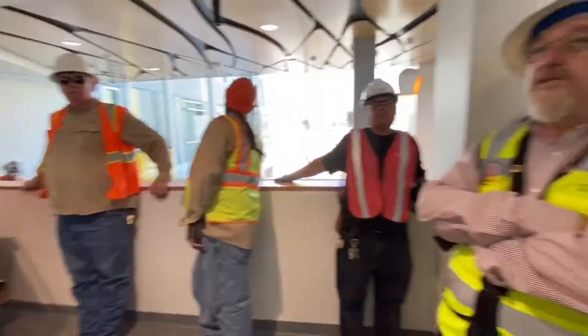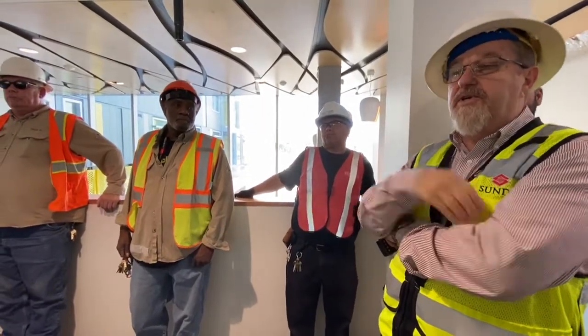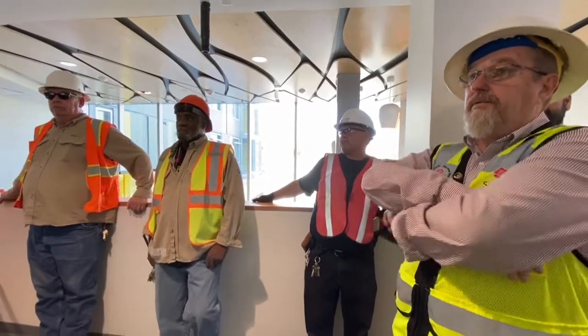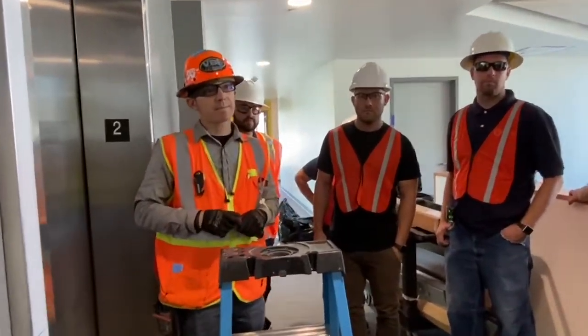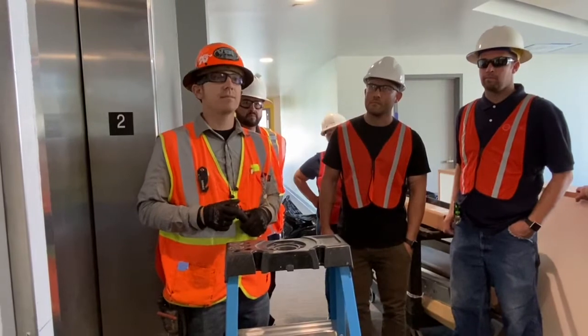Just to reiterate — if we go into a fire alarm drill, will those come down? Because the drill is different on the panel. Sometimes we do drills twice a year. It'll still act as a test and still activate the curtain — the curtain will still come down. When we reset the drill, it comes up automatically. If not, we press the button. But no matter what, we have to go to every floor and put the covers back up.